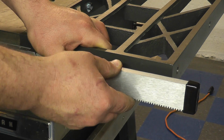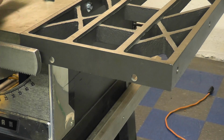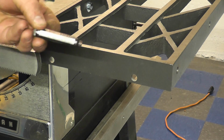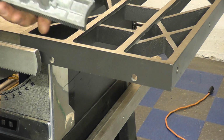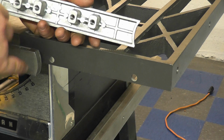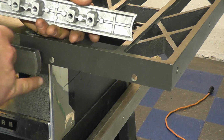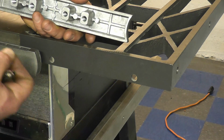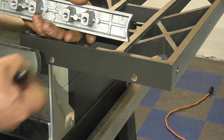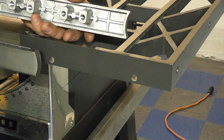I'm going to screw it in place, and then I have some Hyman transfer screws, 5/16-18, and we're going to screw that into the farthest hole away from the one we're using. So we're using this one, we'll screw it into this one, and we'll be able to mark exactly where we need, but I need a straight edge under here. So I'm going to go get my level, and we can clamp the level into place underneath here so we can get everything nice and straight.